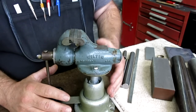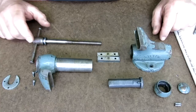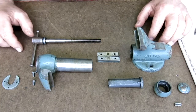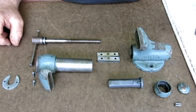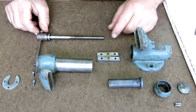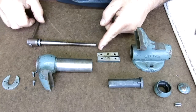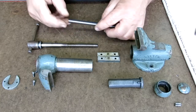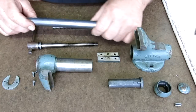So we've got the little Wilton Baby Bullet taken apart here, and once you kind of get it broken down it doesn't look so complicated. Let's go through some of the parts and talk about strategies for how we might attack them. Let's talk about the screw first — it's actually a square thread on the original, but we're going to go with an acme thread on ours. I got a little piece of acme threaded rod from McMaster-Carr that's long enough to work.